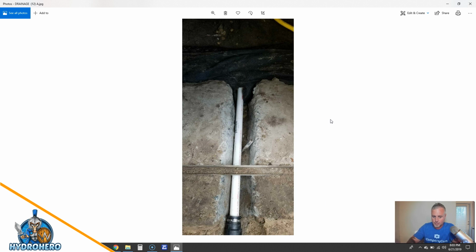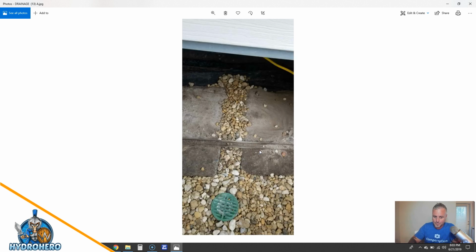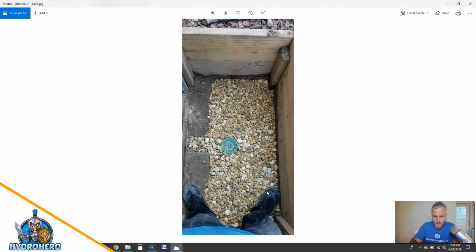So you want to have a drainage pipe in there, and that's what the guys have done here, is put in a drain pipe. So you can see after we cut that out and got that installed in this one, you can't see it now, but we'll actually have this all covered with this stone. You won't even be able to see the drain, and have nice big stone all the way around it when we put in our custom access well. That way aesthetically it looks real nice too, and allows the water to flow in there, and then it's tied right into our French drain system. And again, your access well will give you no problems from there on out.